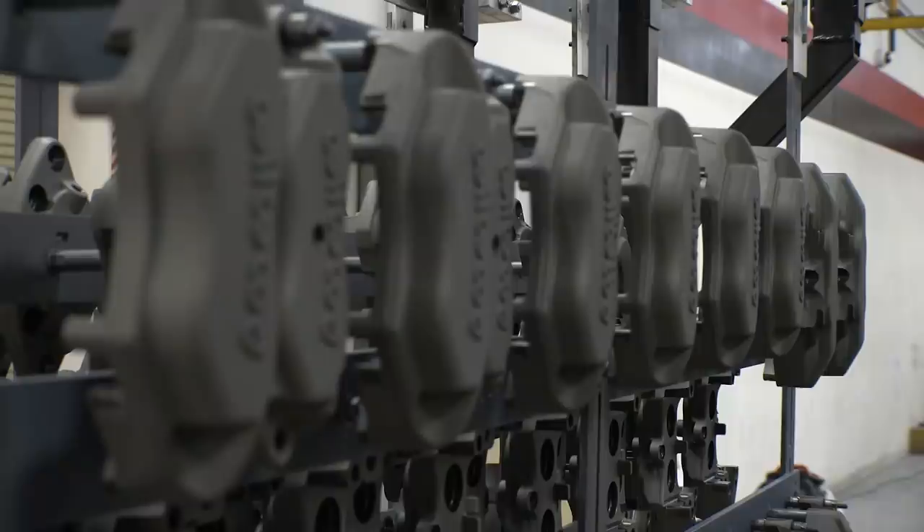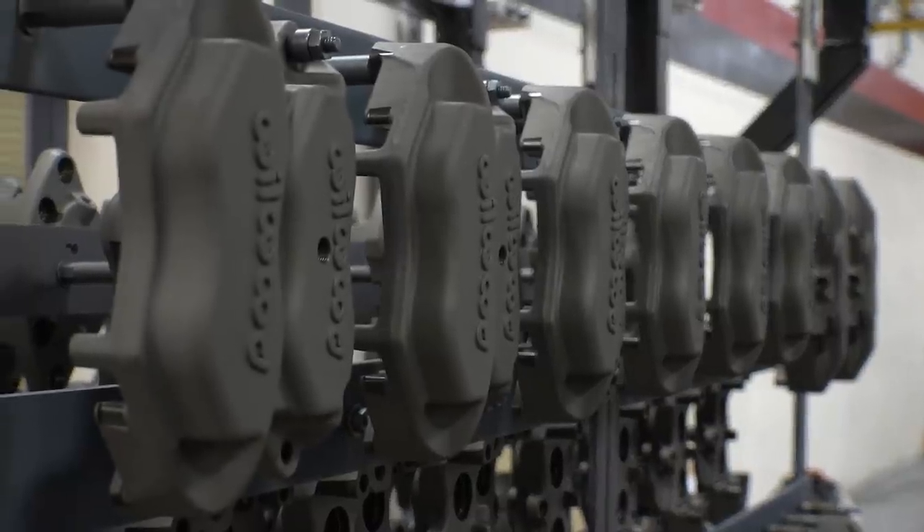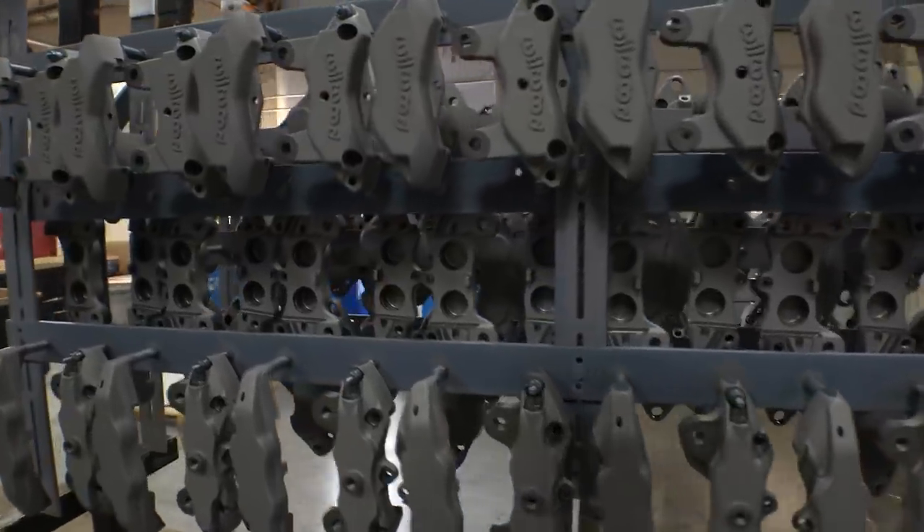The finished parts come out a neutral gray — that's the natural color of hard anodized aluminum. It comes out without dye so it'll be that kind of neutral gray. If you get really in-depth about how the process is done and how it goes into layers, that's why it has a color to it.